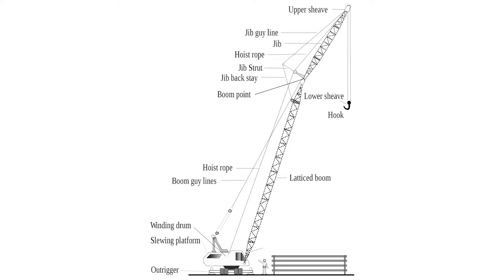When would you want to use this design? They are best suited for applications where the cylinder must pivot through an arc as it extends and retracts, such as with a boom crane or a bin tipper. Also, it is important to remember that clevis mounts require attention when being applied, because they are highly prone to side load and column strength issues.